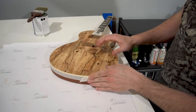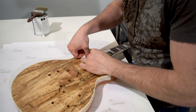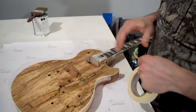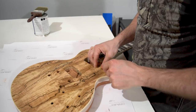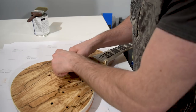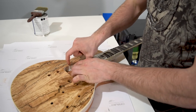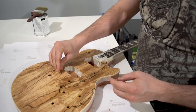For beginners, I recommend you do the whole side. It is a little bit difficult to control this stuff sometimes. But for my purposes, I'm just going to tape one line along the top edge. You've probably noticed I missed the horn there — don't worry, I do go get it. So if you're very OCD, you can calm down. The insides of the cavities, same kind of concept. If I'm spraying, I tape the whole thing. But because I'm brushing, I'm just going to run a line of tape around the top. Make sure you're not having your tape sticking up above the edge, because that can prevent you from painting right up to the edge with your brush and make things more difficult later on.